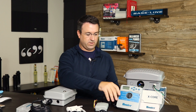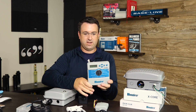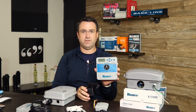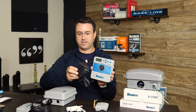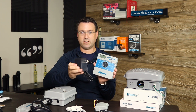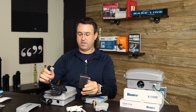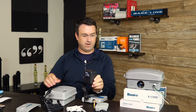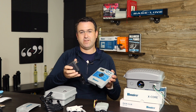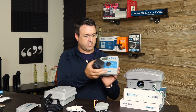On the indoor model, there is no outdoor enclosure and no door. It is meant to be placed right on the wall, typically in the garage, sometimes in the basement. The transformer portion that we were just discussing — this is the portion that plugs into the wall. Instead of being a small wall plug or lamp cord, it's a big box. Inside here is the 120 to 24 volt transformer that on the outdoor models is built right into the controller. So if you don't know what model you have and you're looking for a replacement, take a look at where the transformer is — is it plugged into the wall, or is it built into the controller?